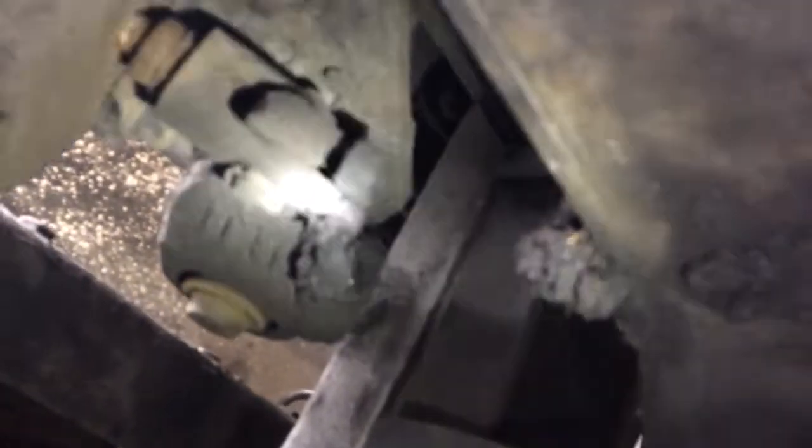There's also a grease fitting on here, so check that when you're greasing your truck. Now I'll do the other one over here. You can see there's a nut right there — that one's tight, that one's good. The only one I have a problem with is this one, so I need to get a slack adjuster put on it.